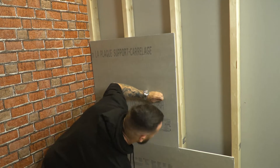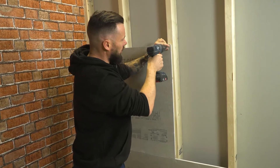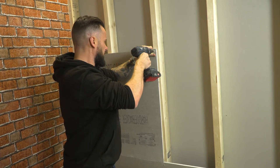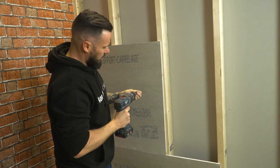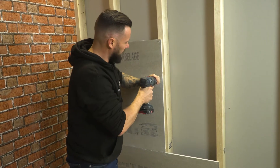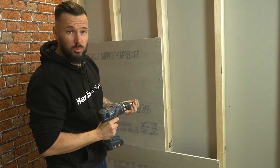All I'm going to do is take a minimum 32mm screw, 10 to 15mm away from the edge of the board, making sure that I'm not overdriving them. Around about 200mm all the way down — it works out around about 12 screws per board.